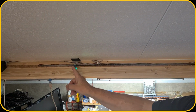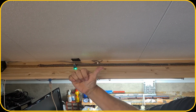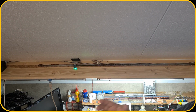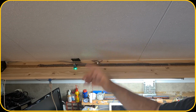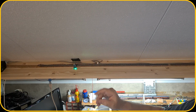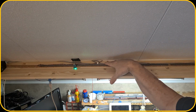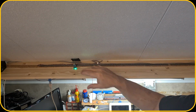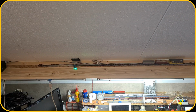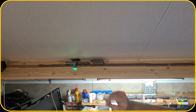So as you can see, I installed the black paper at the sensor, and I did that at the other end as well. That is so that when it's a bright day, the reflection of the wall doesn't hit the sensor, because it absorbs the light. I also added this plank. I didn't screw this all down yet, but this will be where the diversion track will be. Switches will be there. Now you can see that the sensor does work, so the train stops.